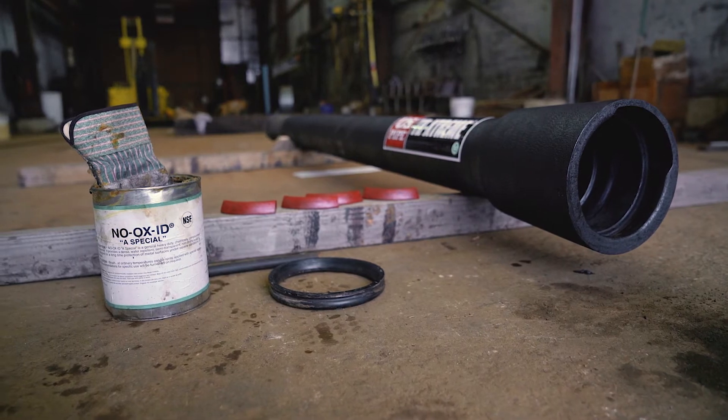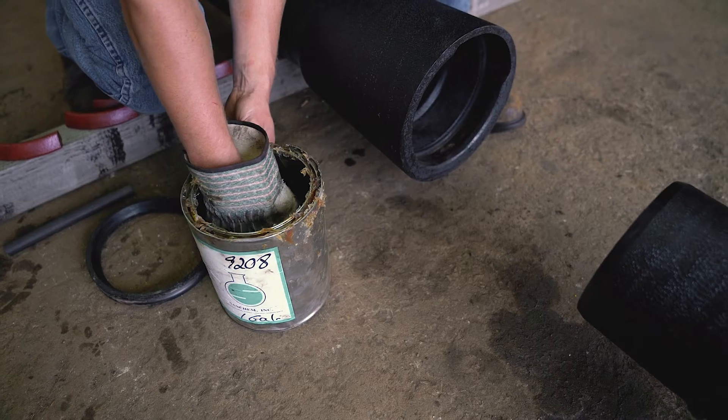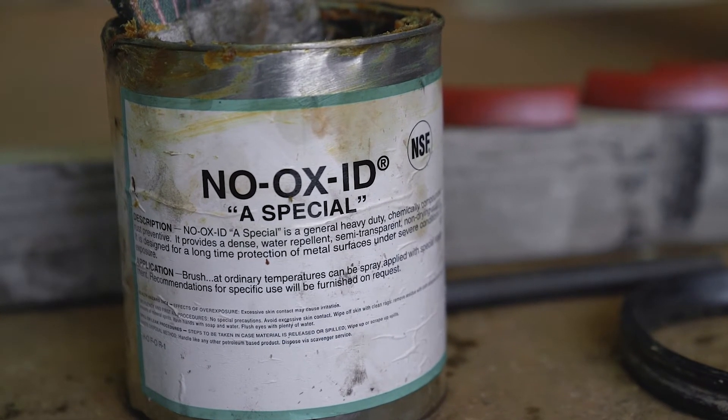TR Xtreme's accessories are supplied in a sealed package and consist of locking segments, rubber retainers, and instructions. Apply a special joint lubricant to the spigot. U.S. Pipe recommends NOAC's ID Lube since it does not dry out and is not water-soluble.